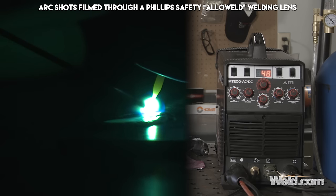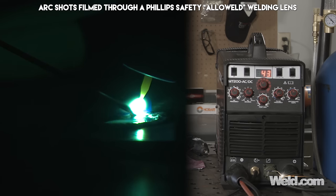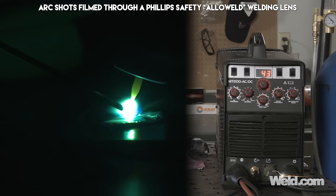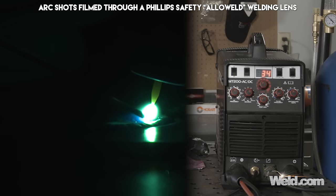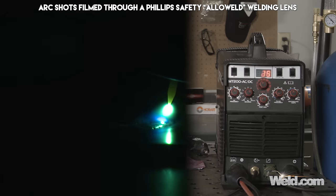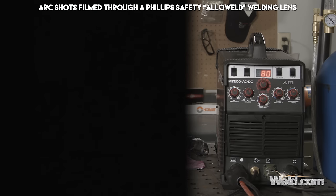Okay, I can see this scribe line. It's just a matter of following it and doing dabs. You can weld backwards like what I'm doing right now. Get out of position, just taper off and stop.